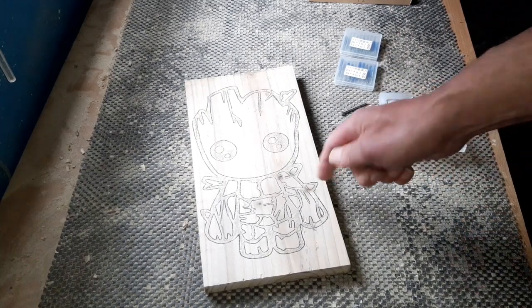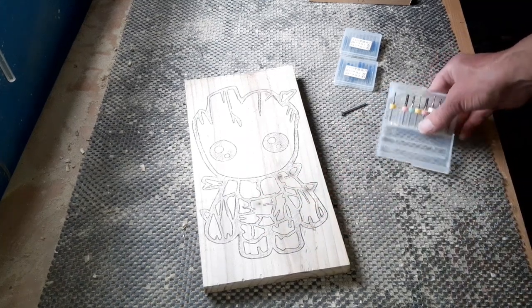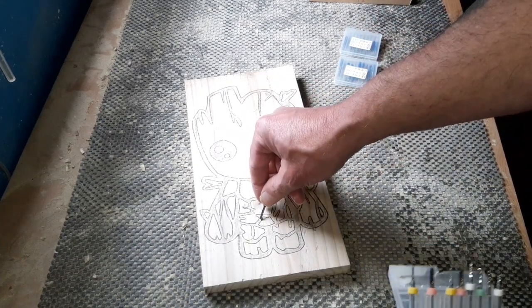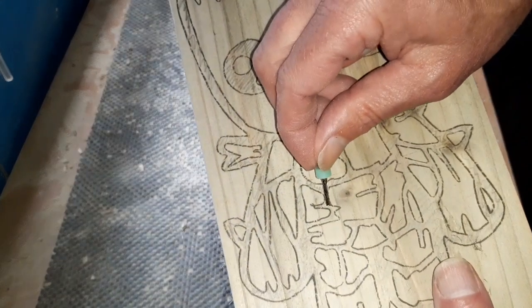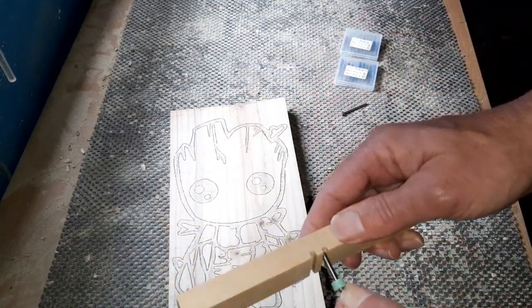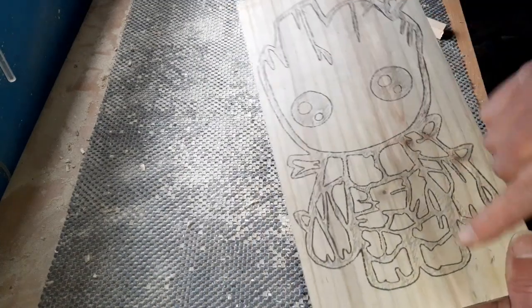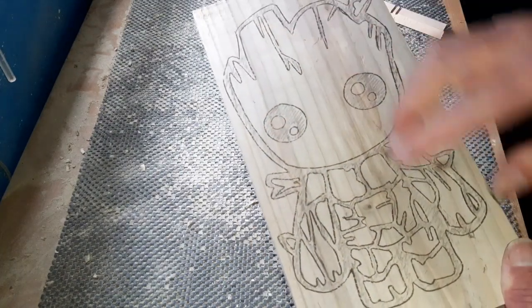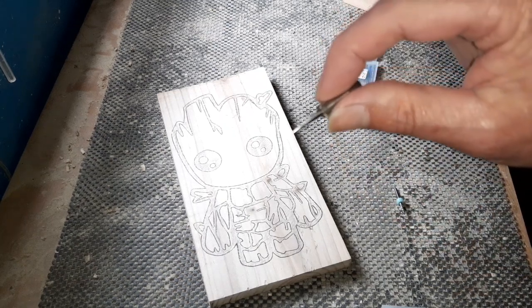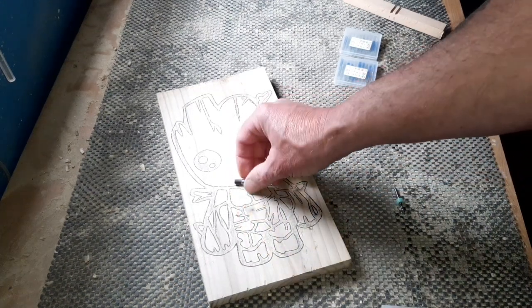All these bits to go around — once I've done all that with this CNC bit, I like to use end milling bits. They come in different sizes. We'll just find one small enough to fit in between the sections and pop that on afterwards, setting it to the same depth. We'll remove all the background and inside the eyes. Once we've done that, we'll cut it out on a scroll saw and then paint the background and sand it over. We'll pop our 15-degree CNC bit in today — nice straight sides — and start going around all these sections at three millimeters deep.